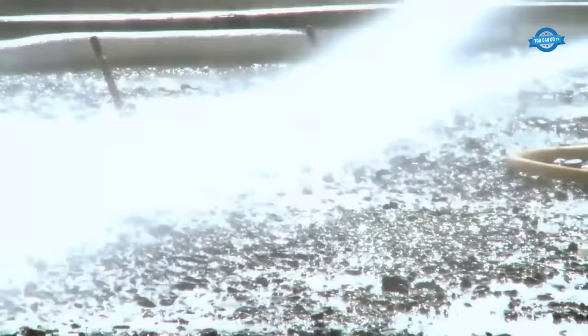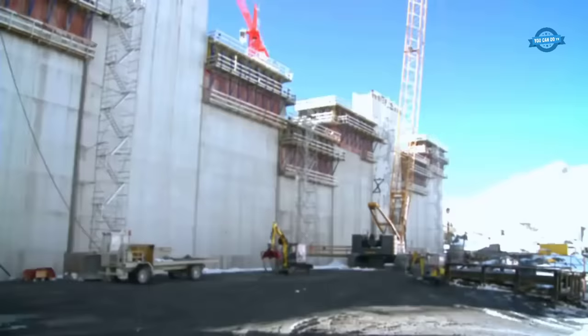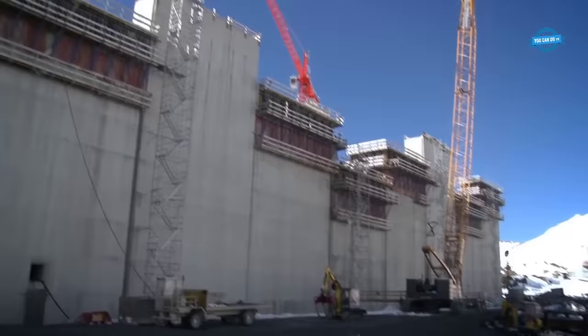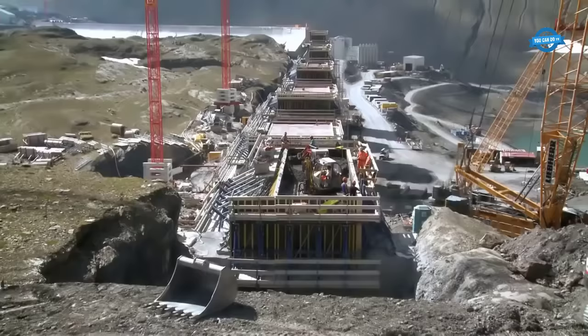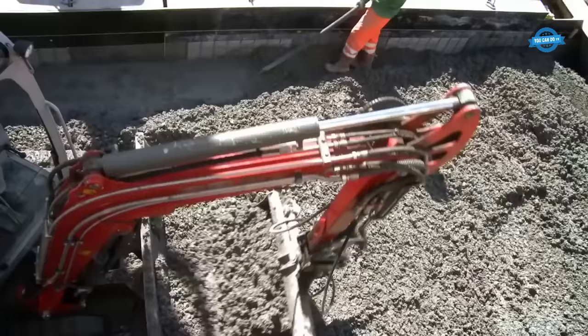The dam wall comprises 68 individual blocks, each 15 meters wide. The blocks were built in alternating order, with the walls serving as molds for subsequent layers. The blocks are interlocked through openings in the side walls, and the site was prepared by removing 2 meters of soil to reveal the solid rock beneath it.